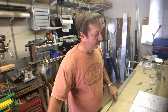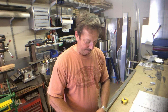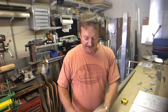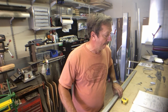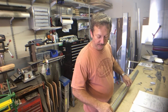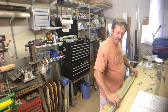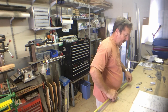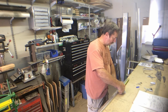The outboard ribs are 410 millimeters in from the end, then 1200 millimeters from inside to inside. I'll double check that. At the other end there's 180 millimeters inboard of those ribs. So if we mount the first one there, we should be right. 1200 to the next one. We should have 180 — and we do.